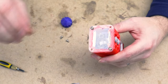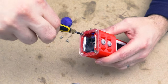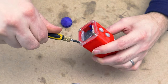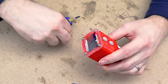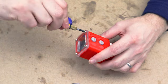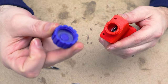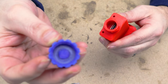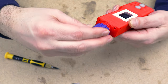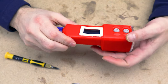To be able to screw the lid on, I've used what's called heat-set inserts — little brass-threaded pieces of metal which you push into 3D printed items with a soldering iron and they melt their way in, then stick in really firmly. They work out really, really well. We take the lid and there's another little bit of silicone which has been greased up, and that just screws onto the 3D printed thread. And that's it — it's ready to go.